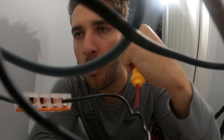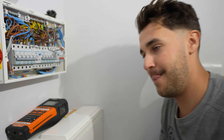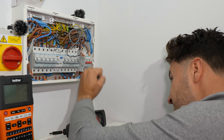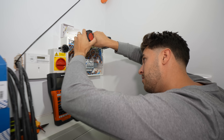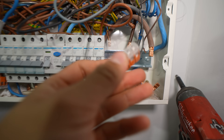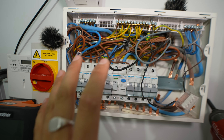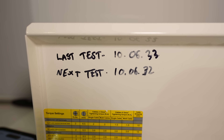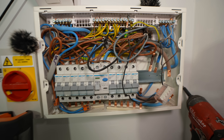I put a camera in here, not because I necessarily thought we'd use this footage, but I always wanted to see what the consumer unit sees. I'm going to take out one circuit at a time — I want to keep all of these devices because there's nothing wrong with them. What the heck even is all of this stuff? When you're in a board like this — and I've been in much worse, commercial boards ten times as big — what you do is take it circuit by circuit and don't go cable blind. We're going to mark off little tiger stripes on each one and correspond them. Look at the labels on this — last tested ten years ago, next test a year before that. Fantastic. Let's just get all this off and start from scratch.